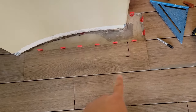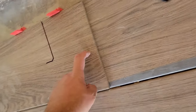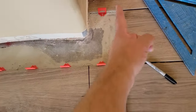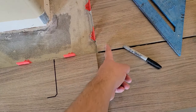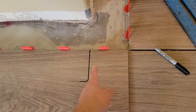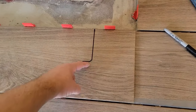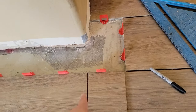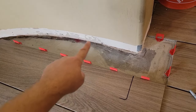We place the tile over the next row, perfectly aligning it with the grout line — it's perfectly aligned. This tile is just sitting on top of this row. I place the tile here as if we already have a grout line between that tile and this tile, then I took a measurement from there to the wall and transferred it here, and also took a measurement from here to there and transferred it — so this line I marked is the corner of the wall.